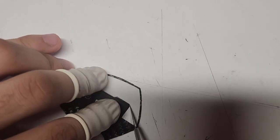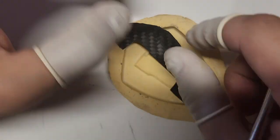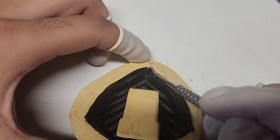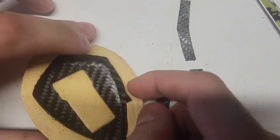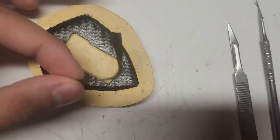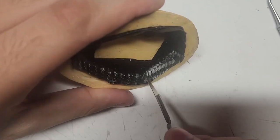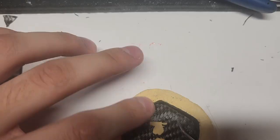Prepreg is a relatively new technology that can have a long shelf life as long as it's stored in a basic freezer. It can be bought online for relatively cheap and it avoids additional complexities such as having to use resin flow tubes or improper mixing of the resin. The prepreg is somewhat tacky which allows it to stick to the mold and to other pieces of itself. This avoids the use of gel coat which is needed for regular carbon cloth. But the most important reason I'm using prepreg over regular cloth is because dry cloth is unstable in smaller pieces — the tows fray off very easily at the edges and the pattern distorts with the slightest movement. Since I'm prioritizing the aesthetics of this piece, it's more practical to work with prepreg where I'm able to make precise cuts without any fraying and easily line up the edges without accidental overlap or distortions.